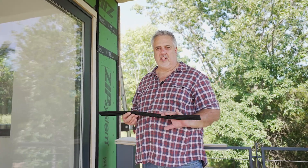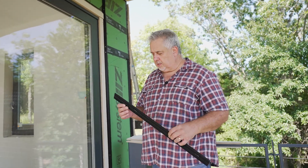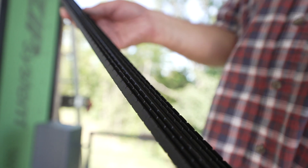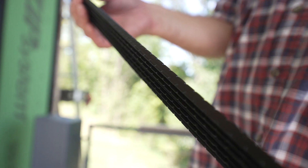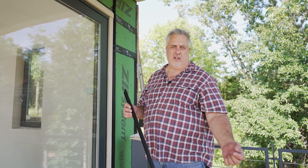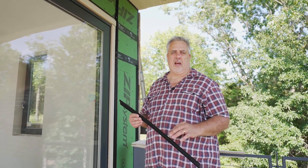We're live from the Hilltop Barrel Project. I'm standing out on the deck waving this piece of plastic — this is Benjamin Obdyke's Batten UV product. You've heard me talk about rain screens before. Rain screens are nothing more than furring the siding off of the weather-resistive barrier to provide a gap that allows water to drain down and out, but also allows ventilated air to move up and out, to take any moisture in there and dry out the backside of the cavity.